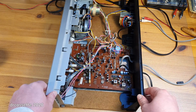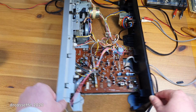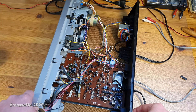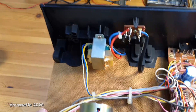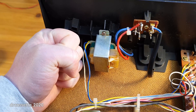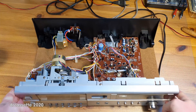The bottom panel, as you can clearly see, is made from high-density fiberboard. They did stick a little bit of aluminum under the circuit board to provide some shielding, but with a plastic back and a plastic front, I don't think there is really too much shielding going on. And around here we have an absolutely tiny transformer. Fist for scale — this transformer is tiny. I would trust it with running the dial lights, but certainly not with running a whole entire cassette deck.